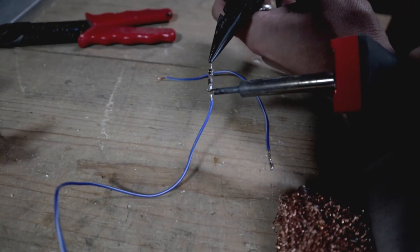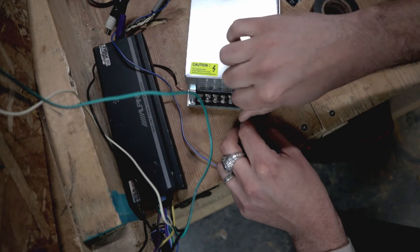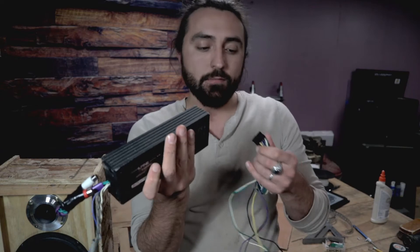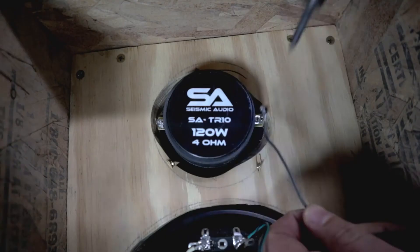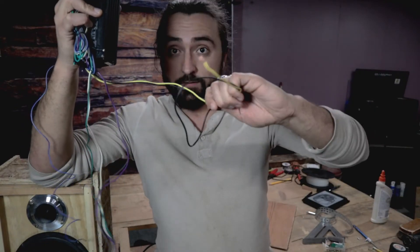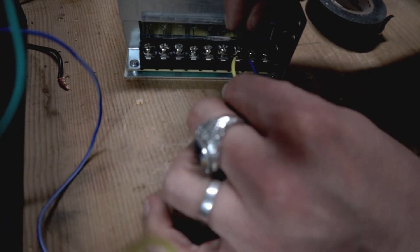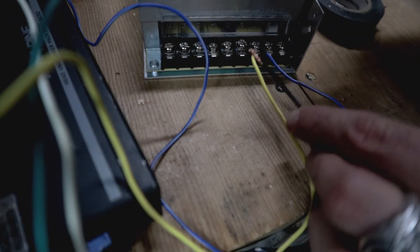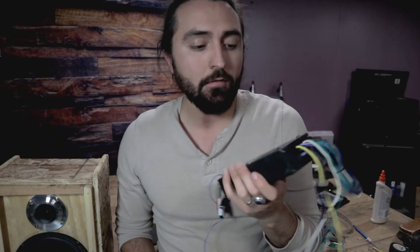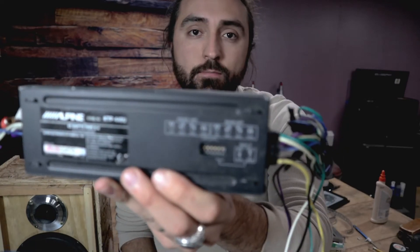If you're not going to use a keyed connection in your car, you want to put a fuse between this wire and the power source. So this fuse is going to hook in-line with this blue wire up to the power supply. We also have this other harness that comes out the back end of the amplifier — these wires run into the speakers and feed them. This yellow wire is constant power, which hooks straight up to the power supply, and then ground is just ground. There are also these little switches in the back — you've got to make sure you're in the two-channel bridge configuration. Pretty straightforward.